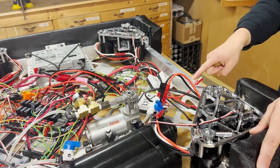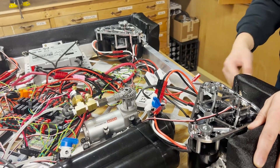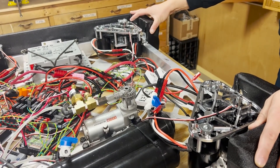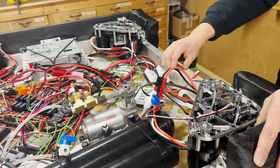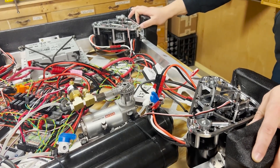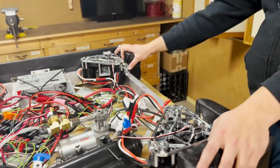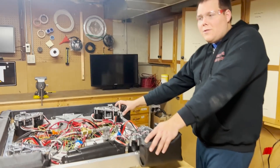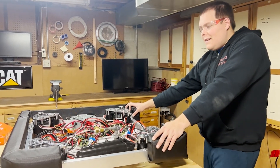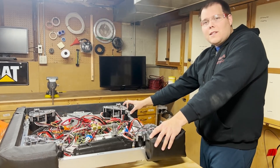The frame is two-by-one tubing, which you can purchase from AndyMark. It's one-sixteenth-inch wall and plenty strong for this application. That is our swerve drive and we're looking forward to seeing everyone for the new game — hope you tune into the stream.